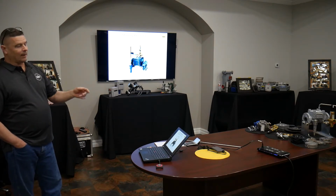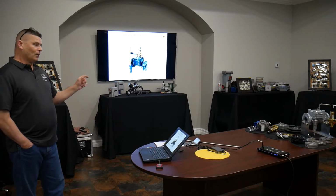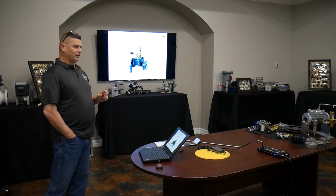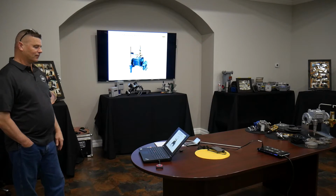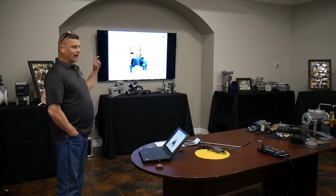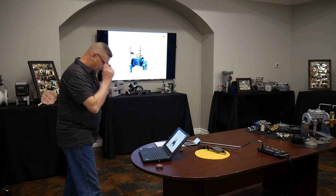Okay? A lot of times the serial number is what I go to for the rest, because I've got to figure out what throttle plate went in there originally or what diaphragm went in there originally, especially if the tag is all goobered up, and all I can get is certain information. The serial number is also stamped into the side component, so if I can't get it off the tag, I can get it there. Okay. All right.